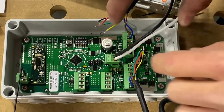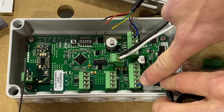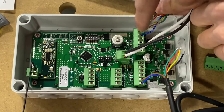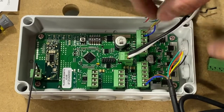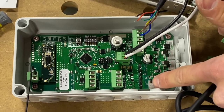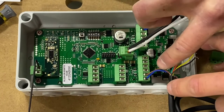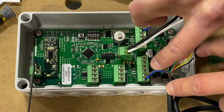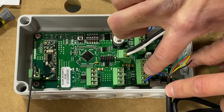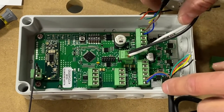If you look at the circuit board, you've got your brown wire here and your blue wire here, and it's repeated — brown on the right, blue on the left. If you get confused, you'll see a positive and a negative marked. The positive is always associated with the brown cord coming from your 150mm motor. If you're hooking this onto landscape cable, make sure you're still running from the brown line.